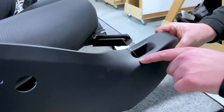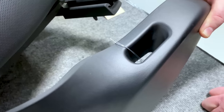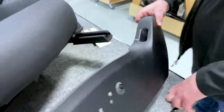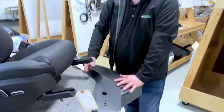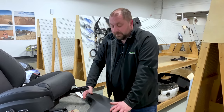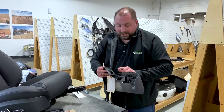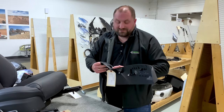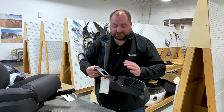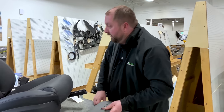Can you see this line through the camera here? That is an A-surface parting line because that is two different chunks of the steel tool that move independently of each other. Normally you want to avoid any type of an A-surface parting line. They're very difficult to manage. Some tool shops will say, well, we have a zero parting line condition, blah, blah, blah. It is still visible, but this one is rather good. I don't feel a burr. I don't feel flash, as we'd call it in injection molding, but the line, it's still there.